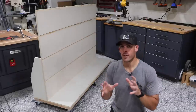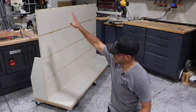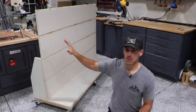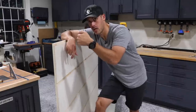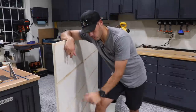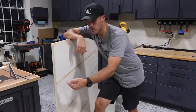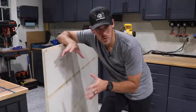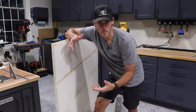With the front vertical dividers done, on the reverse side we're now going to tackle the back, which is going to have the angled part for laying big sheets of plywood. The angle is exactly six degrees. So the way we're going to do this is put in a top shelf with that six-degree bevel cut on one side, then cut the long vertical rails that go down the cart. The build plans leave all of this stuff with a little bit of extra stock so that you can trim them to size.